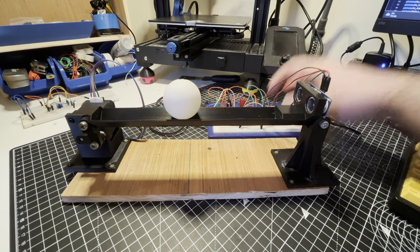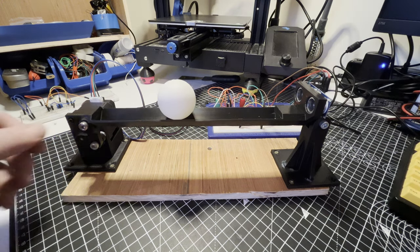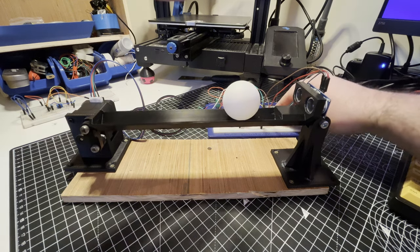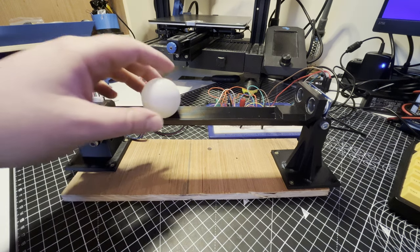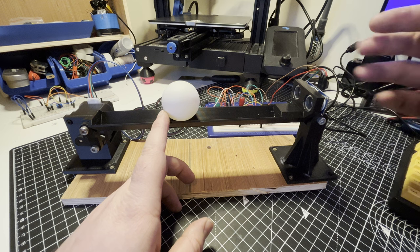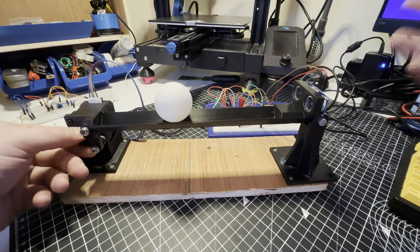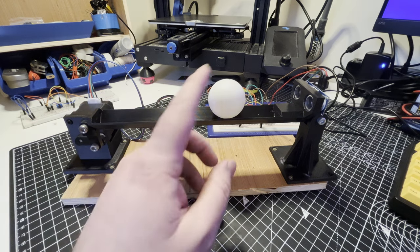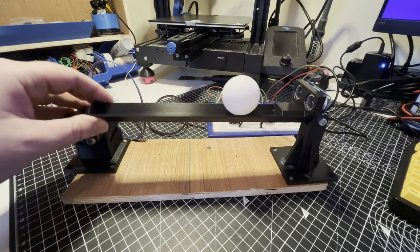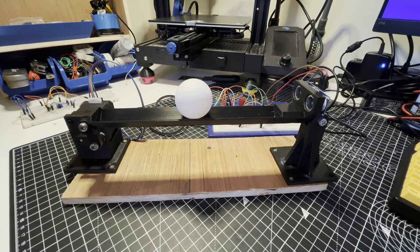If I hit the reset button and start from scratch — now the motor is off, then it kicks on after about two seconds once the sensor has calibrated itself. So you can finely set that if you want to make sure it's level. Previously you couldn't because as soon as the whole thing was powered on the motor was energized. In your setup with the kit you'll be able to choose what stepping mode you want: fine steps for really smooth but slower motion, or a lower stepping mode which is faster but has less granularity — jerkier movements but the speed might make it perform best.